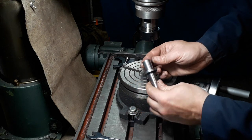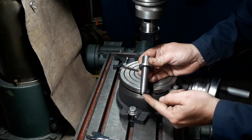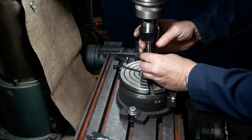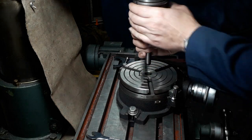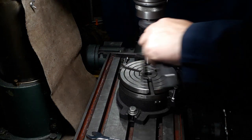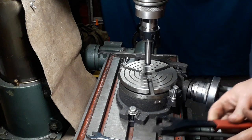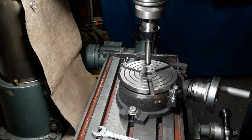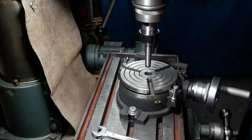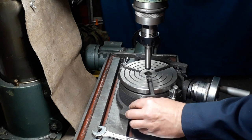Machine this in your lathe first of all - obviously leave it a little bit short if you want - and then that's it, you've got it forever more. Never use it for anything else apart from this, and trust me it will save you a lot of time and it is proven to be very, very accurate. So first thing we do, we put it into the collet and tighten it up - just like that. Now that's in; this is now centered to your spindle.